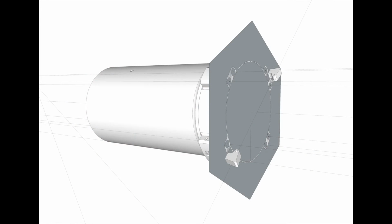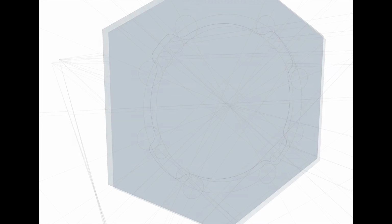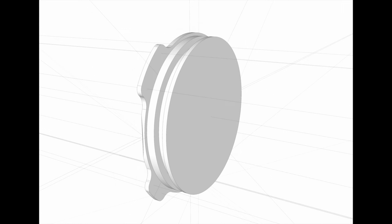The 3D object creation began by placing an oversized working surface on the rear face of the shroud model completed previously. The curvy outline of the collar was laid out via guidelines and circles. The now unneeded guides and excess arcs were deleted and the remaining arcs joined to form the basic outline. The surrounding 2D surface was removed and the collar outline was extruded to give it thickness matching the collar back plate. Additional depth was added to the front of the collar, including a large groove for the gasket that seals the shroud to the collector head.